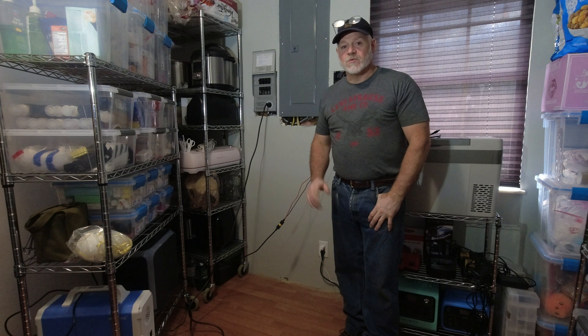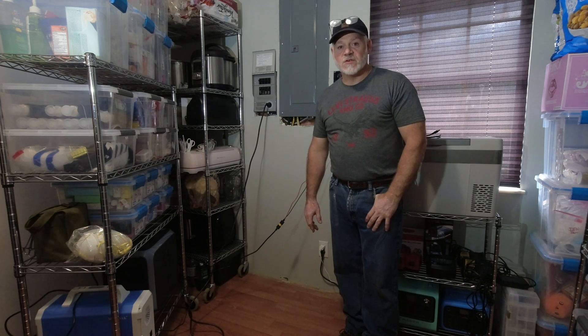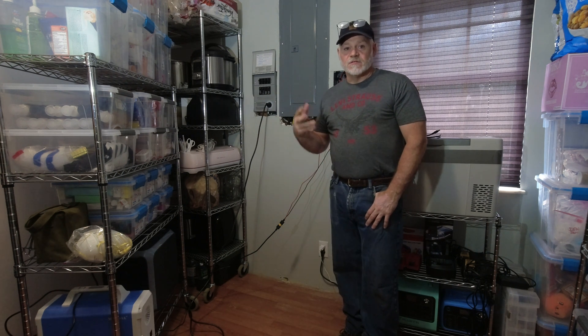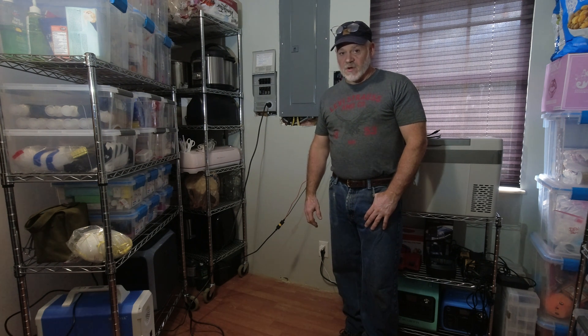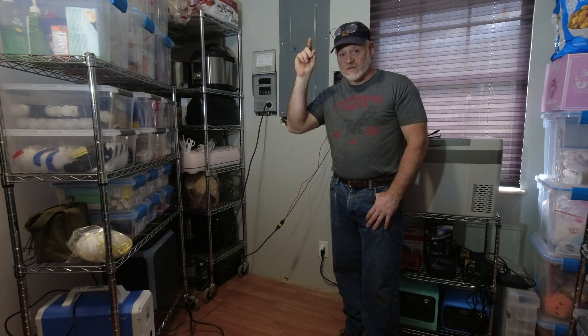Welcome to the channel. I want to show you the semi-finished product of the 800 watts of Rich Solar panels on the roof running our AC200P, hooked to our transfer switch we showed you in an earlier video. We have four circuits isolated for emergencies to keep our refrigerators running, give us some lights, maybe a little entertainment and a microwave so we can cook in the event of an emergency. We've got the system up and running with 800 watts of solar panels on the roof.